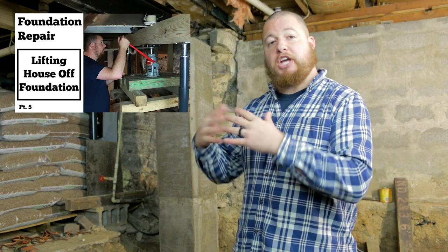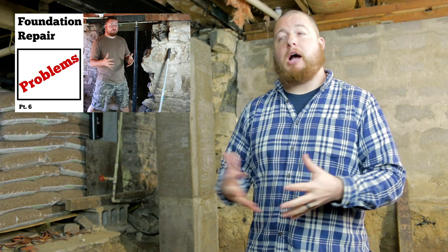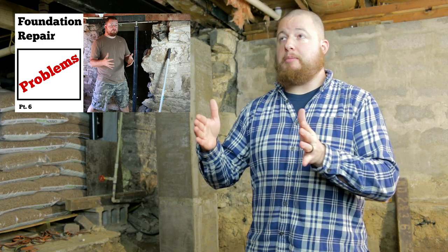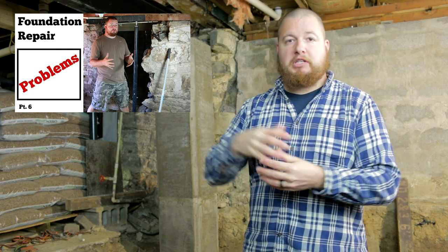And then we went into our fifth video, which is actually jacking up the house. We had a sag in our floor that we straightened out, and we also lifted it up off of the foundation wall. And that leads us into our sixth video, which is where we ran into some issues or problems. There was a rim beam instead of a rim board, like traditional framing. This is a house built in the early 1900s, so they had a rim beam, and the walls were being supported on that. So as we lifted up on the joists, it kind of cracked them a little bit because all of that weight was on the beam instead of the joist.